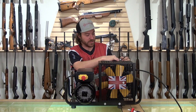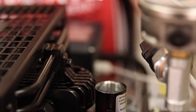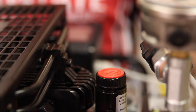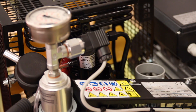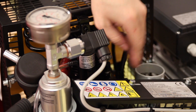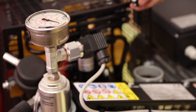Next to the blow-off valve, you'll see where the oil is applied — a big red cap that says 'oil,' set in place with an O-ring. This is where you dump the oil in, and right next to it is your vent plug. Anytime you add oil, grab a 14-millimeter and pop that off — it allows the oil to run in quicker and smoother, then the cap goes back on once you're done.